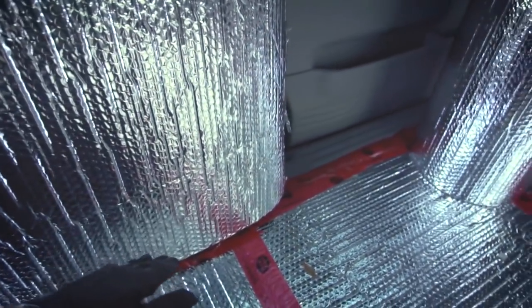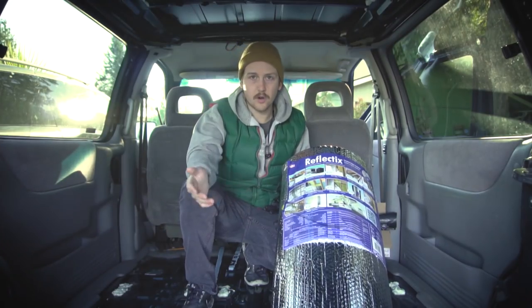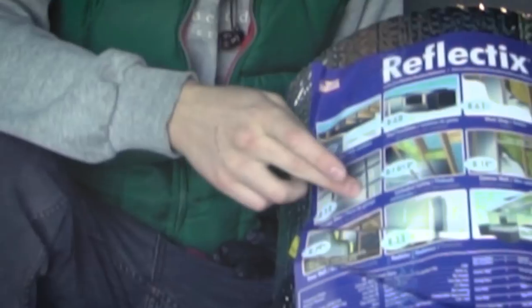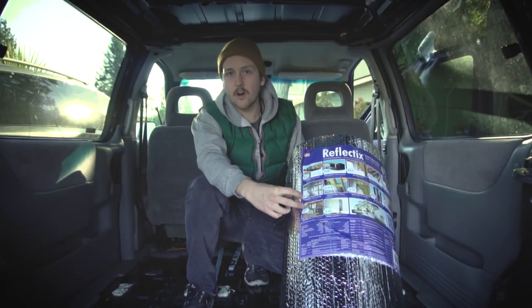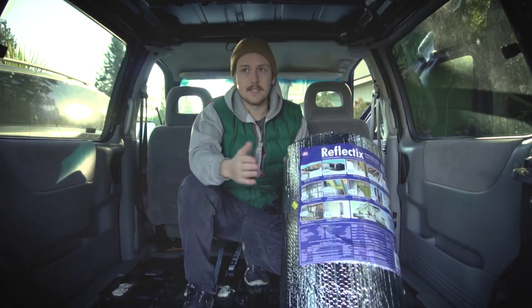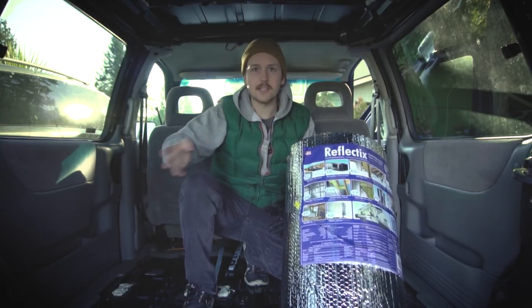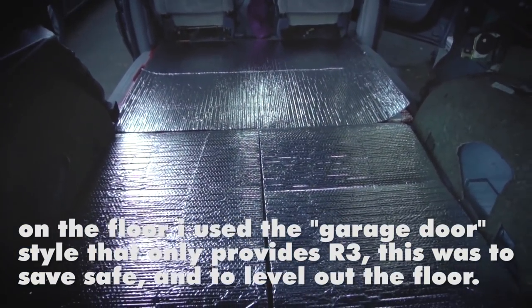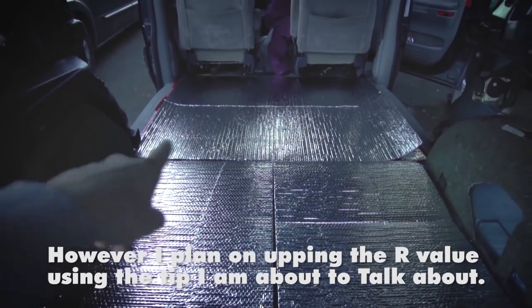This material is quite thin. What's happening is the air gets through one layer of reflectix eventually and then bounces back and forth, which creates a really good layer of insulation. You want to use that principle in your build. This other example shows you only getting R3 from one layer — essentially just put against a garage door, reflecting one layer of heat. R3 is a lot less than R21 because there isn't an air gap between layers.